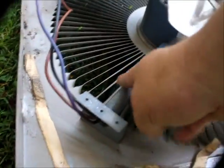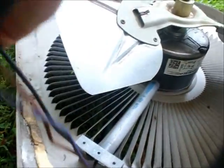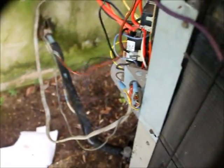Have the PVC pipe. The PVC pipe is there to stop the wires from hitting the blade as they spin around, and your wires are going to come down here. So I definitely said the wrong color on the wires. Okay, before you put the fan in place, angle it in such a way where you can get your hand down here and not crimp these wires as you have them standing by. Alright, so definitely don't pull on the wires so we're going to break the tips off. And we're going to feed these through one by one.